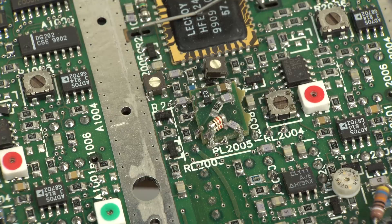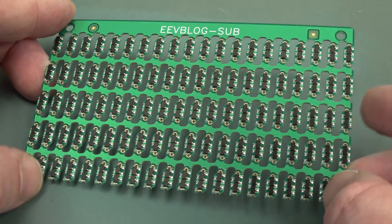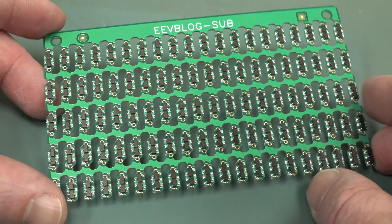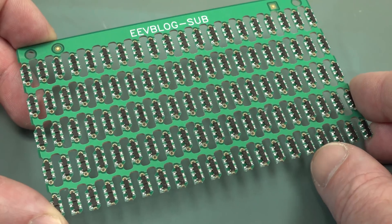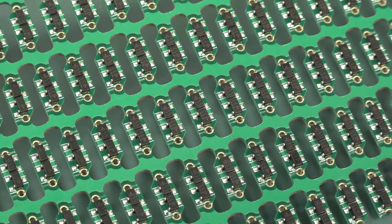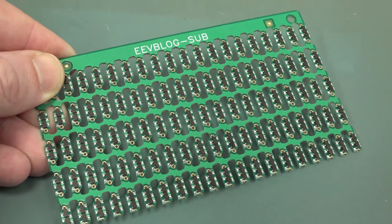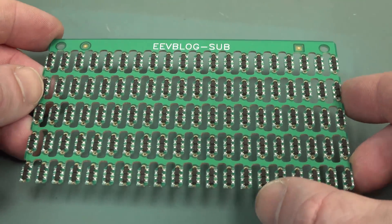Or just easily solder them down in production. Or, as we'll see in a minute, actually treating them as a pick-and-place component and reflow soldering them. Here's an example of a mod board panel. In this case it's for the 121GW multimeter, where we wanted to upgrade an existing part on some already populated boards. It was an SMB part that we upgraded to two SOT23 parts like this. So how do you do it? Well, let's take a look at the details, because this is just one example — there are many ways to do it, but there are lots of issues which go into making a board like this.